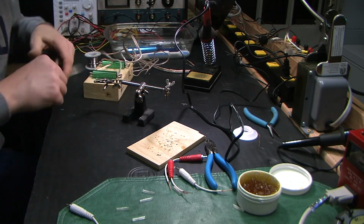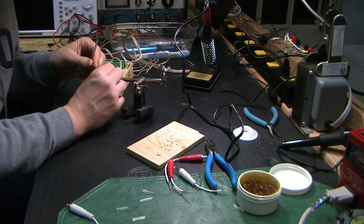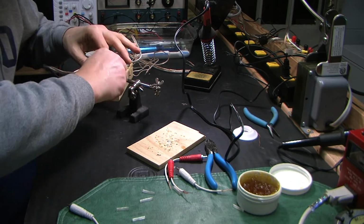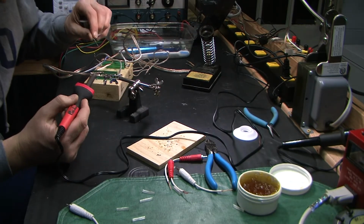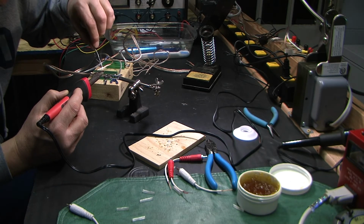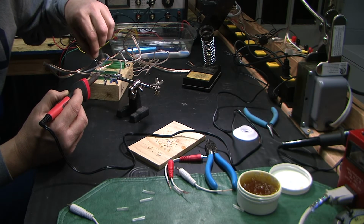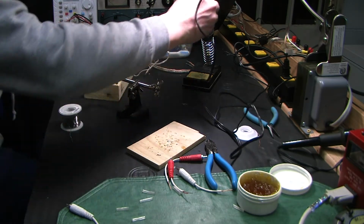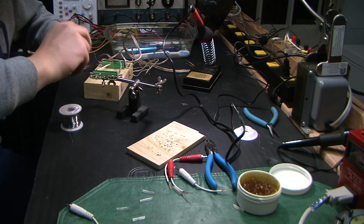So, might want to put a signal in there and step through it and see what's going on. But again, mostly I'm interested in the thing being able to turn on and produce a signal without any crackling. I'm mostly interested in making sure water didn't do damage to it, and making sure that those caps, power supply capacitors, are good. And that's the biggest concern, given that this amp, like I said earlier, was sitting around for years and not getting use.